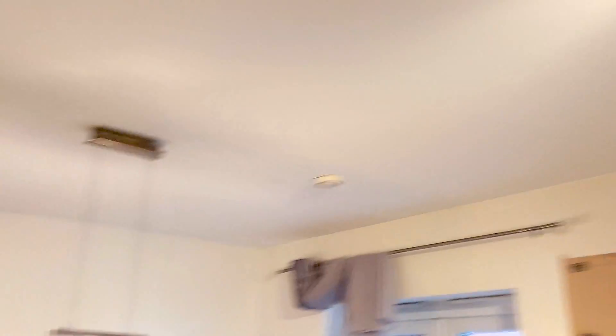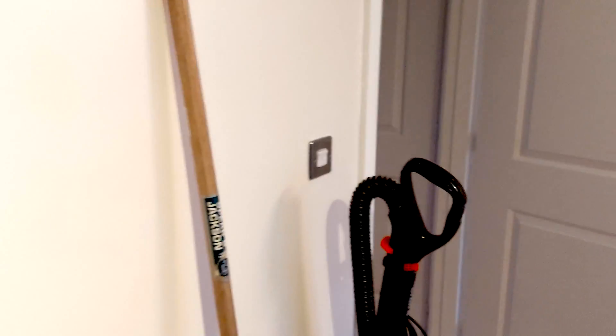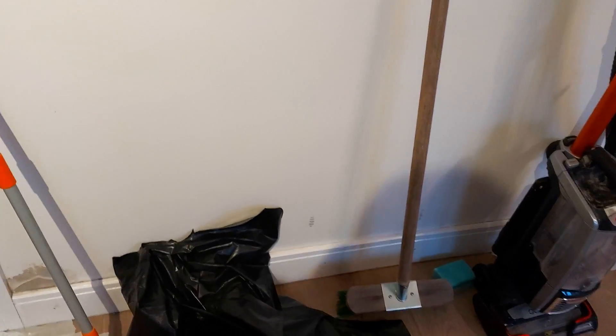Then in the ceiling we've got to get rid of these two lights, put eight downlights in, and a couple of pendants over what will be the worktop. Try and reuse that switch. There's also an outlet going to the fridge freezer, so we're going to chase down there and crack into it from above somewhere.